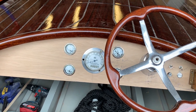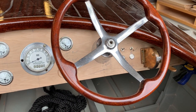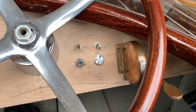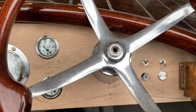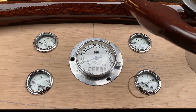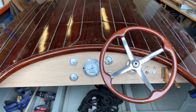I'll take that out and transfer it to a piece of mahogany. I'm actually going to cut this on the CNC machine, so I'll take measurements off this blank and draw it on the computer, then cut it on the machine. The main reason for that is to get all the holes the exact right size for the gauges and switches. These are going to need some little recesses on the back edge for the switches since they're only quite shallow mounting. I just need to profile the top slightly, marking plus five mil and plus ten mil along that top edge so it sits up into the bulkhead correctly. It's looking quite nice.